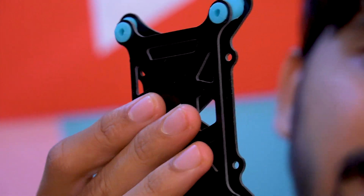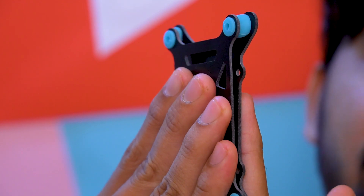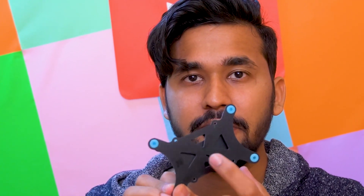You might simply use double-sided tape and stick the flight controller on the frame, but this board has an accelerometer and gyroscope inbuilt. Mounting it directly might be risky because there are lots of vibrations that can affect the signaling and processing. So I recommend using an anti-vibration pad, which will isolate any vibrations and even electrically isolate the flight controller. We will use double-sided tape on the back of the anti-vibration pad and on the back of the KK 2.1.5 and simply stick it.